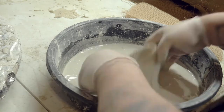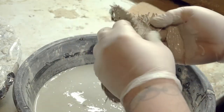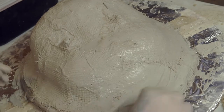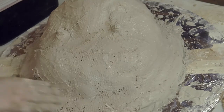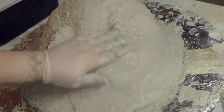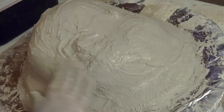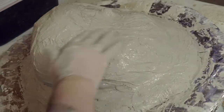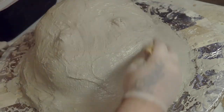You got this! When handling your mold edges, you don't want your burlap to hang over — but it's not the end of the world if it does; it's mostly an aesthetic rule. After the mold has all its layers of burlap, use the remaining stone in the pan to build up more thickness and clean up the look. You're doing great — only one more layer to go!